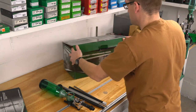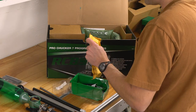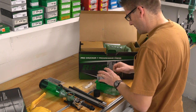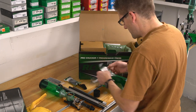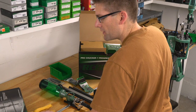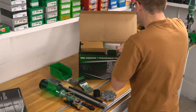Now we've got a bin of accessories here — the completed cartridge bin holder. There's a drum. For this press there is only one drum because it uses special metering inserts — dual metering inserts, one for pistol and one for rifle. We've got the primer chute, the spent cartridge chute, mounting hardware, priming parts, the primer punches, and the primer tube base. That's going to be our completed cartridge bin. We've got the tool head — seven stations — which is going to make for some mega die-station utilization with lots of great options.